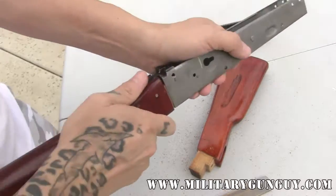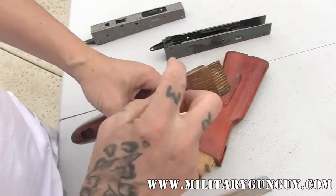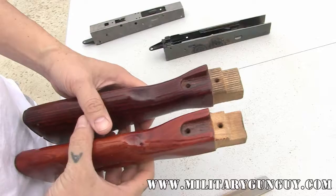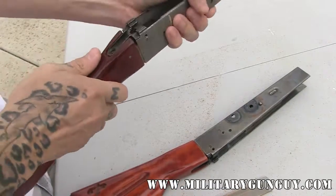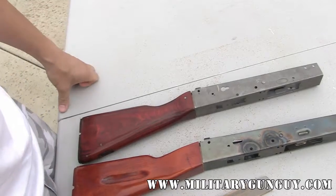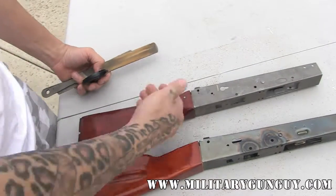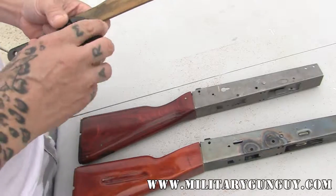So this gives you an idea of how this works, or at least how I do it. Little by little you'll start to see these gaps closing. When you're done, you can touch this area up with leather dye, get it all nice and cleaned up, and hit it with another coat of whatever top coat you use — whether it's shellac, polyurethane, or whatnot. Once it dries and you've got this thing perfectly fit, it will actually be ready to install. You want to get this pretty much perfect, so that way when your final rifle is assembled, you don't really have to mess with it as much. That's basically how to fit an AK stock to a receiver — you'll be doing this if you get one of the kits that requires fitting to the receiver and the rear trunnion. Any questions, email me at militarygunguys702@gmail.com. I hope you like my videos — please subscribe, and thanks for watching.